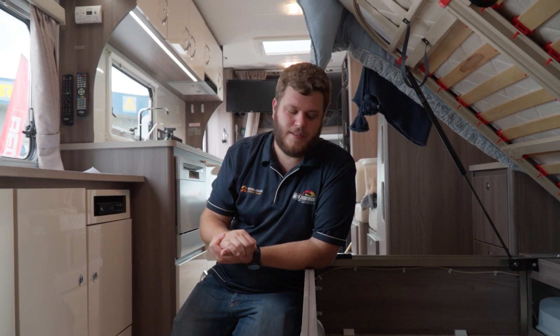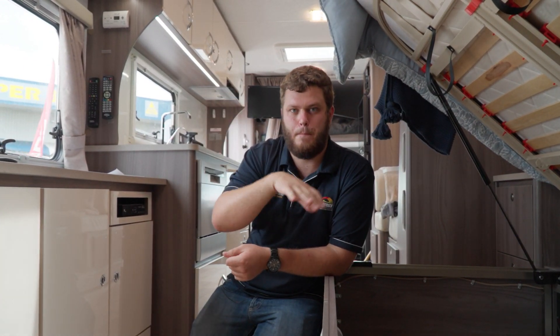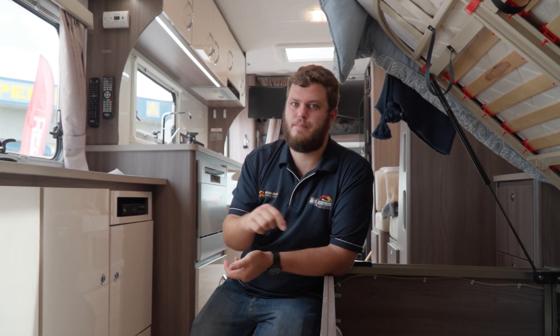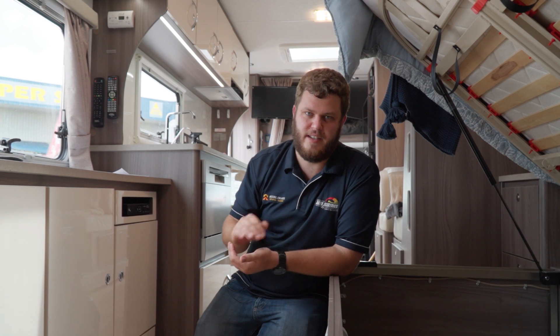After the air con runs for around six to seven hours — even more depending on conditions — and hundreds of uses of kettles, toasters and that sort of thing. The batteries themselves have a five-year warranty and a built-in Bluetooth monitor. In an off-grid setup like this, we actually use a separate battery monitor — the Enerdrive E-Pro — to monitor them as one bank. But you can also log into each battery individually on your mobile phone and see exactly each one's health, its charge, how quickly they're charging or discharging.